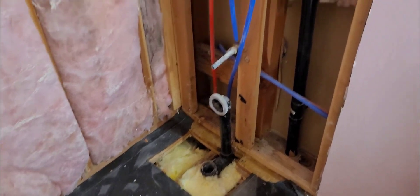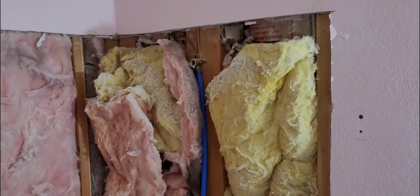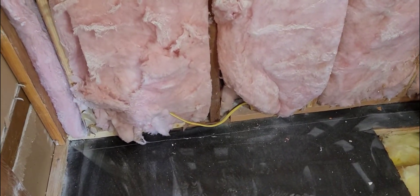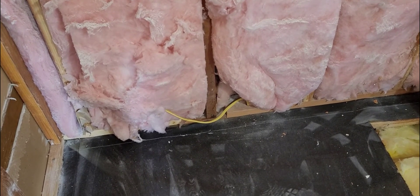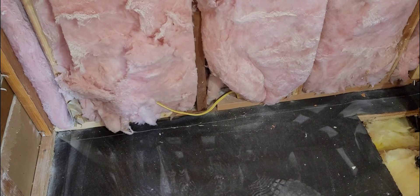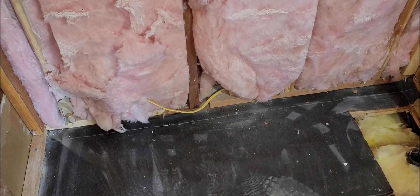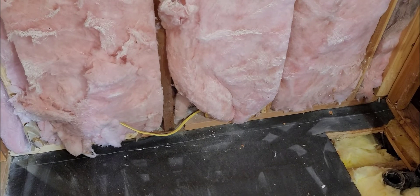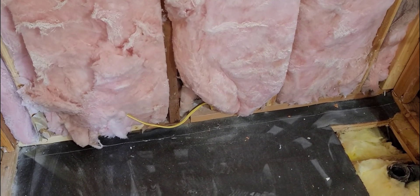This wraps up removing a bathtub shower surround. Here's what it looks like when you're all finished. I want to point out again why you want to be safe. Because the bathtub is one of the first things installed when you build a house — before all the framing is up — the bathtub is already in. So whoever did the electrical ran this wire around there up to a microwave plug in the other room. They didn't care because there was a tub there and it was never going to move.